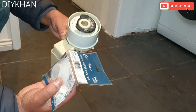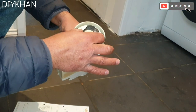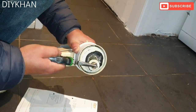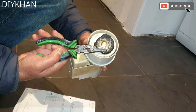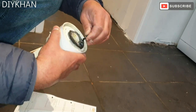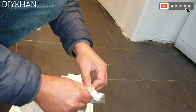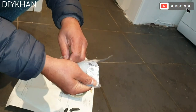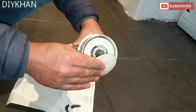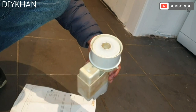So that is the flush valve seal and the clip. The way I'm gonna remove the old seal is I'll get the long nose pliers — there we go, that's how I've pulled the clip out. You can see it's all deteriorated. Once we change this valve seal and put a new clip, it'll stop leaking. The new seal goes in like this — push it all the way in, simple fold procedure.